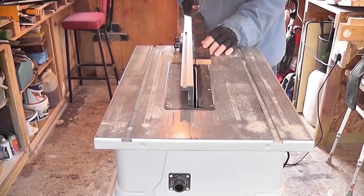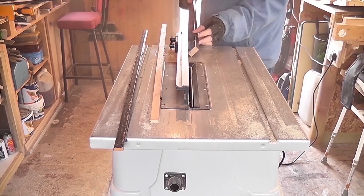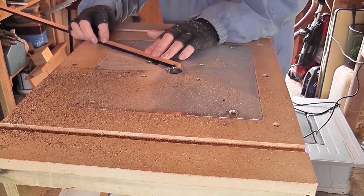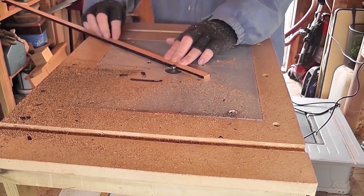Next is a very important part of the build in terms of looks. You need to rip about half a dozen or so thin strips of wood from any type of timber you'd like. Over to the router table — router both face edges with a quarter-inch round-over bit. As you'll see later on, this will give the illusion of tongue and groove planks. Cut your router strips to fit the walls you just ripped on the table saw. I'm using my chop saw but you could just as easily use a hand saw.